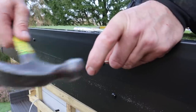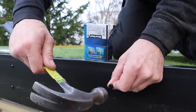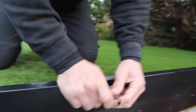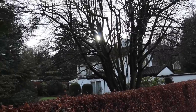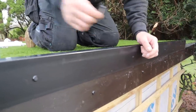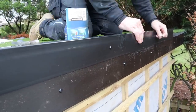I'm pushing down because I've got the grass on it now — there we go. What I'm thinking is this could become quite a common thing for us: you look out your window, you've got this big black expansive roof, you've lost part of your lawn — but now you've got it back. No maintenance at all, UV stable so it won't fade, won't rot away, doesn't need cutting, and visually it'll look bang on. It's also got a little bit of thermal property because it traps air.